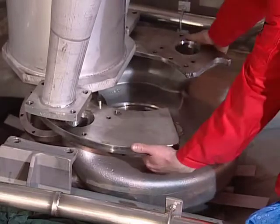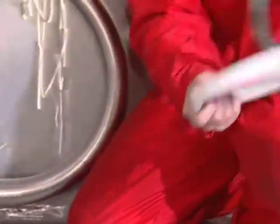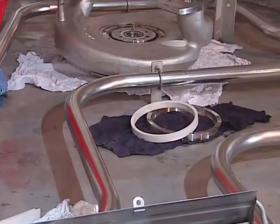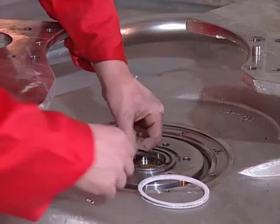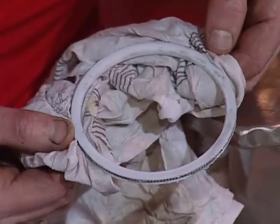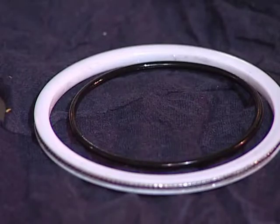Slide the unit out of the well. Remove the upper wear ring and inspect it carefully. Remove the seal element and the o-ring between impeller and impeller hub. These are usually parts which are fit for future use, but they have to be inspected and cleaned before assembly.